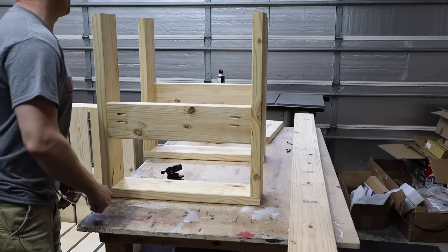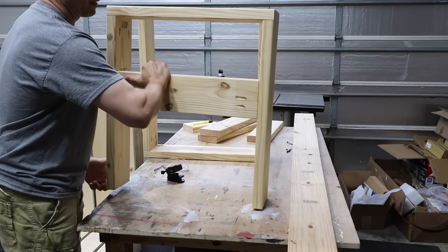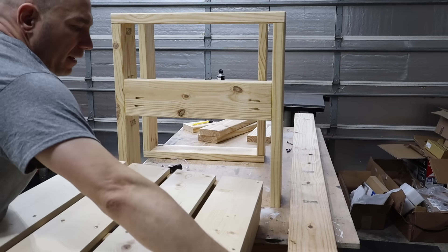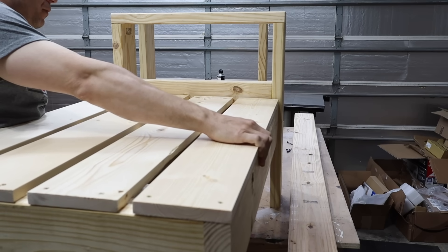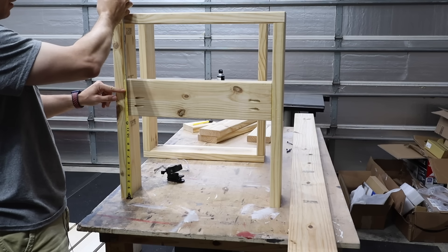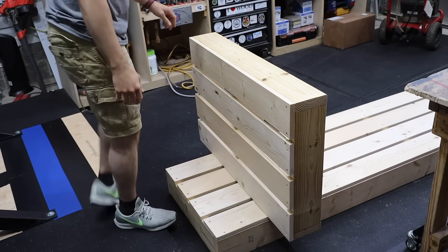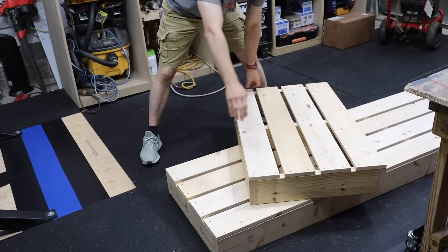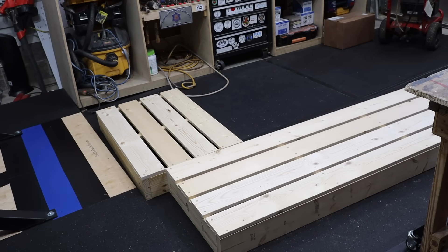This is the leg assembly. The section will actually attach to this side — this is the leg assembly will sit like this. Your frame assembly will actually come in here like this and those pocket holes will be covered, and that's why you turn them that way. We'll actually mount the top of the frame at 17 inches here. Full disclosure: you won't have to worry about this because I've already corrected this in the plans. This is the backboard — I'm going to take it off and make a longer board because that's actually going to come together like that.